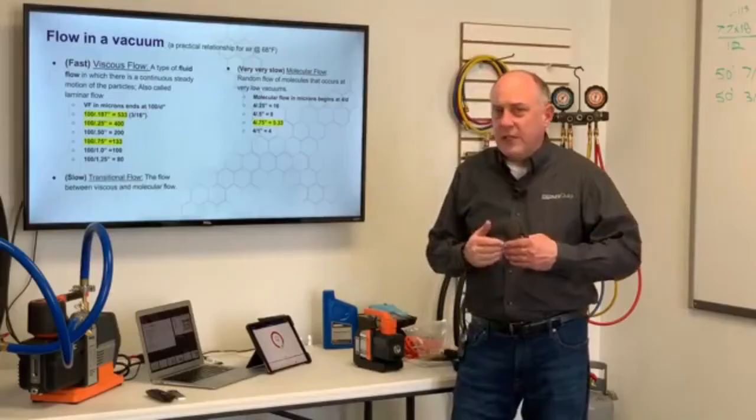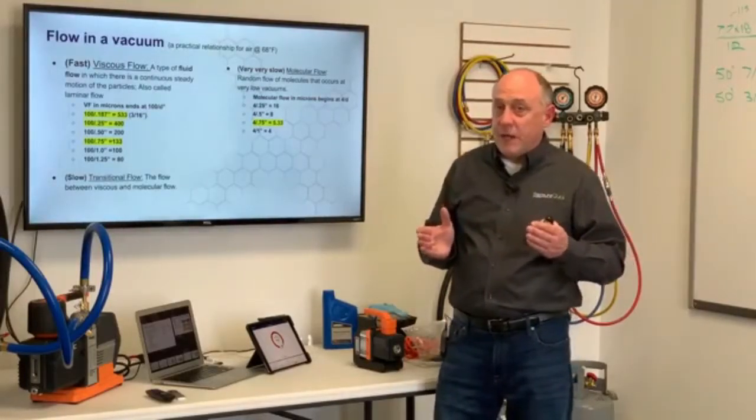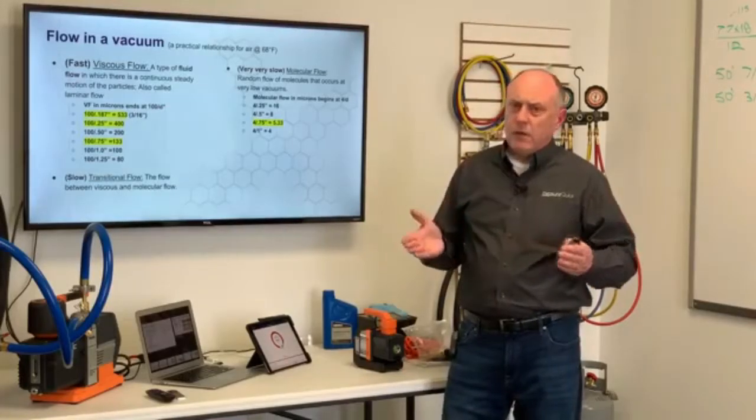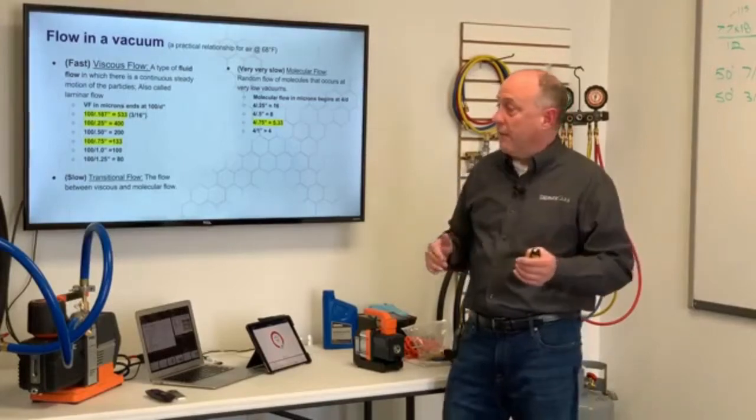Because think about what we're trying to achieve. Typically, we want to achieve, believe it or not, a finishing vacuum of about 100 microns if we can. But a lot of you guys are going to say, well, I only go to 500 microns. And that's because, honestly, I think as an industry, we forgot. And I'll cover that in a later slide here.